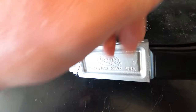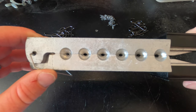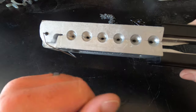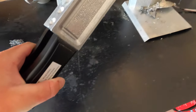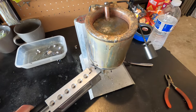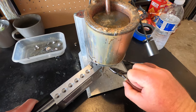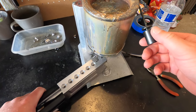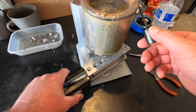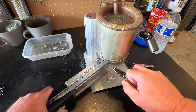We're going to close up this mold just like that. Like always, you want to make sure everything is nice and flush on top of the mold so you don't get a bunch of flashing. Then we go over to the lead pot, take out the nail — I like to put a nail in there to stop it from dripping — make sure we have a good flow, and pour it in.